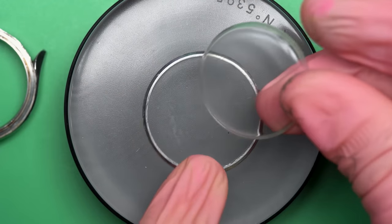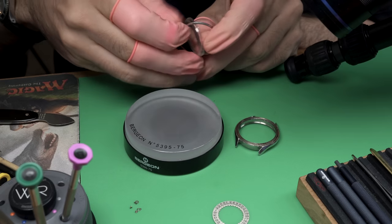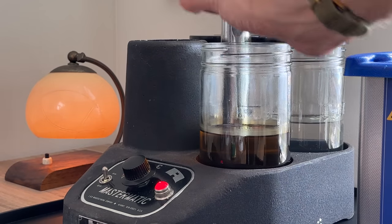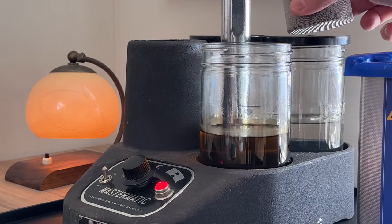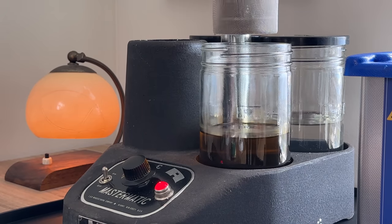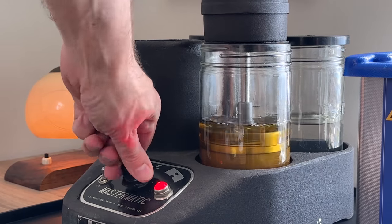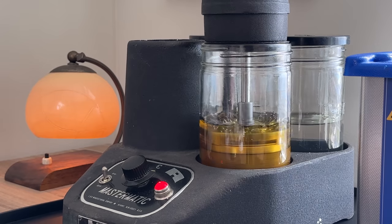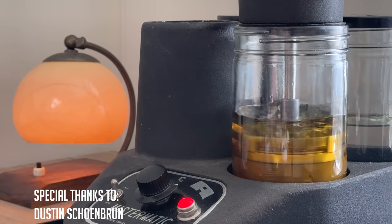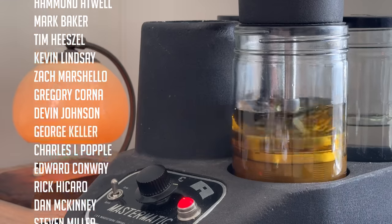Here's the main case, and here's the bezel and the crystal — I can just push that out. The bezel squeezes around the outside edge of the crystal and makes the watch waterproof. I'm not really happy with the crystal, so I'll probably look to find a new one. But while I do, I can go ahead and get this watch all cleaned up. That means it goes into my LNR Mastermatic watch cleaning machine from probably the 1930s or 1940s — it sits in a jar with cleaning solution and goes back and forth.